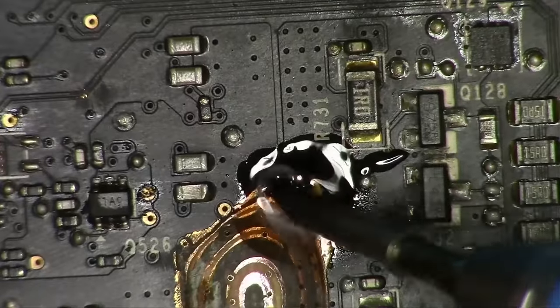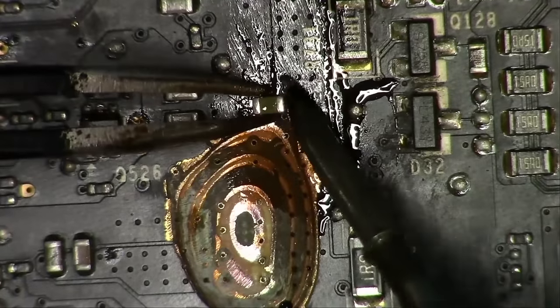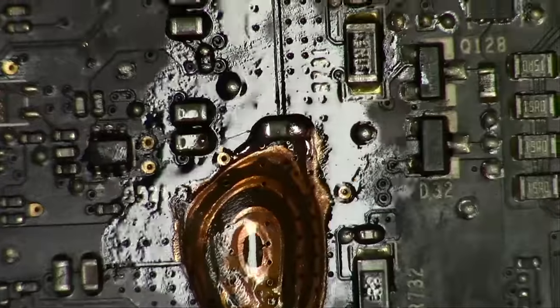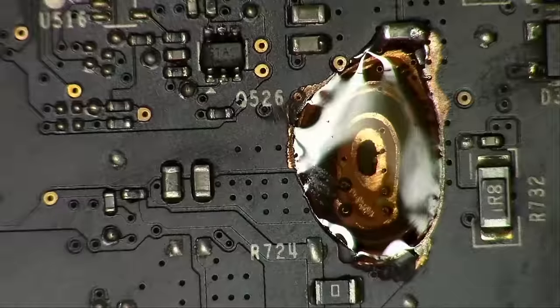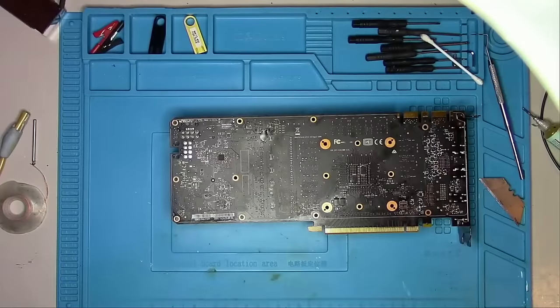If you remember when we bored a hole in the back, a few capacitors were removed. Those are 12V filtering capacitors. I don't need to rewire all of them, but I will add one here at the top. Then I will fill this hole with epoxy, then with the mask, and let it cure under the UV light. And this is basically the final result.